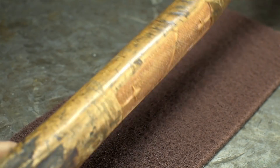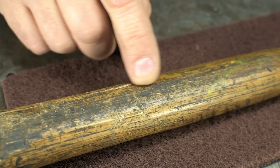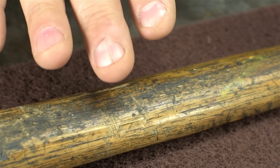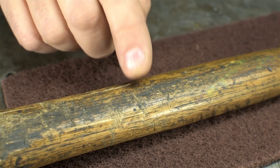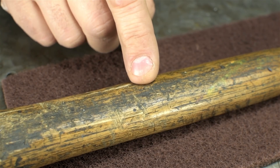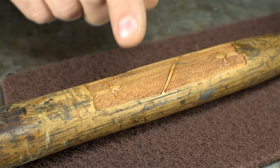And problem number four: the handle itself. If you take a look at the original surface, it's pretty bad. This hammer is old, it's full of crud — oil, cracks, pits, blood, sweat, tears — lots of tears. And as soon as the bit hit the surface, it started throwing little pieces of wood everywhere; they were just chipping off ahead of the cutting load. I wager, just having done this same exact exercise in a better workpiece — some nice dense walnut maybe — it would have looked 10 times better. Still amateurish, flat-topped checkering, but a lot crisper than what we're seeing here.